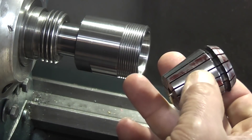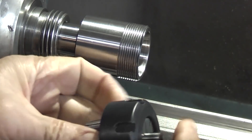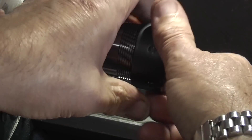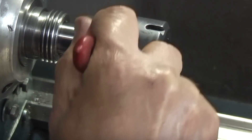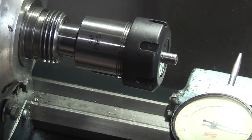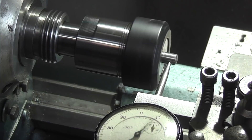So I'm getting the ER32 collet — this is the one we used before when I ground the bore. This is the nut that came with the collet holder. I'm putting in a ground dowel all the way through, so I know when it squashes on the collet it's using the full length of the collet. Let's tighten the collet up. We'll check the run out of the dowel. Now we know the bore is running true — that's running out three thou.